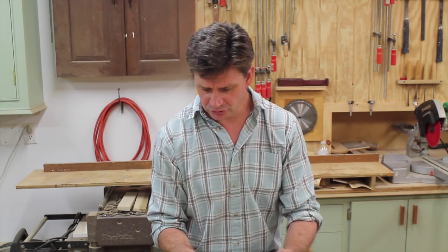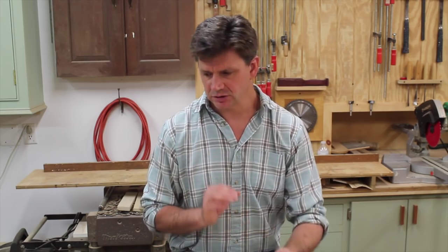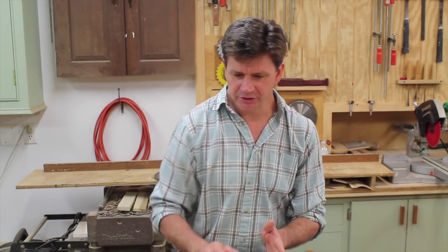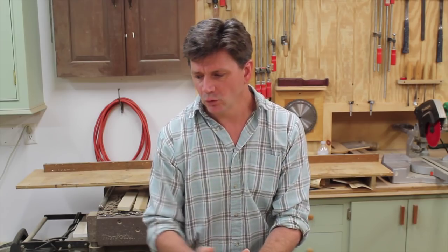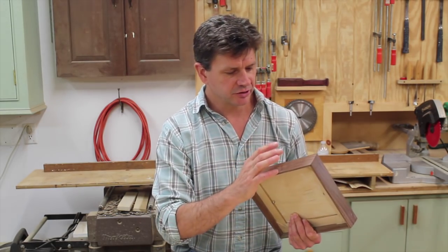David Carlson asked whether the brad nails were really needed in the walnut strips on the outside of the frame. Yeah, I think they were — it made it a lot easier. I could have glued and taped them together, but you really don't see the brad nails on the sides of the frame. I did fill the nail holes. Gary Moore asked what I used to cover them — I used sawdust and five-minute epoxy, using sawdust from sanding the frame collected off a piece of cardboard with a credit card.